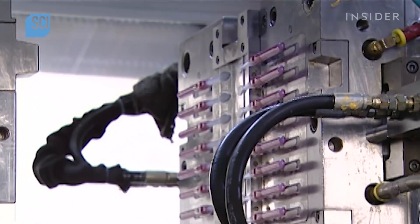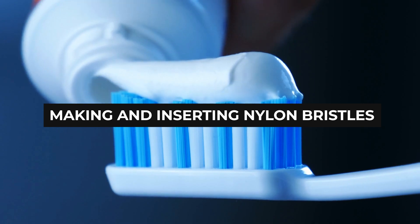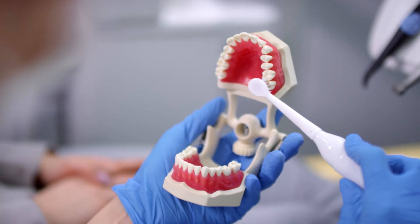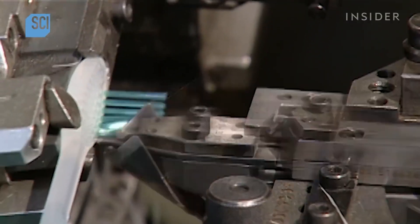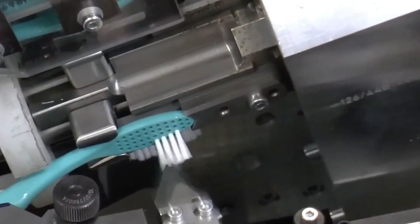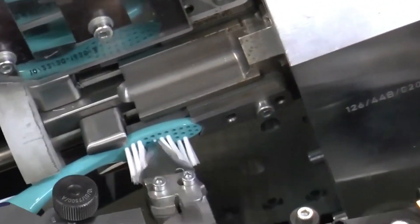Making and Inserting Nylon Bristles. The modern toothbrush with soft nylon bristles was the first type of toothbrush to ever be mass produced. According to dentists, soft bristles are a necessary component of an effective toothbrush. A robotic arm folds nylon fibers over and puts them into place automatically, so the placement is exceptionally even and accurate. The bristles are fed into the holes made in the head of the toothbrush handle and attached with tiny metal staples. A machine then trims the bristles to a uniform length.